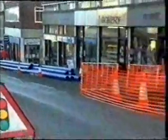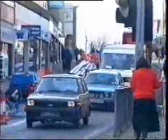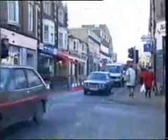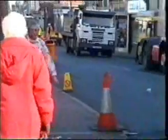This project shows a swage lining operation of 1,200 feet, or 400 meters, of 250 millimeter high-density polyethylene pipe into a 10-inch cast iron main in the high road of a busy town center. It is essential prior to a swage lining operation that the main is internally inspected using a closed-circuit TV system. This survey identifies the requirements for mains cleaning and the location of tees or pipe bore intrusions requiring removal prior to swage lining.